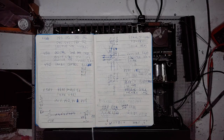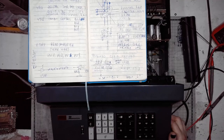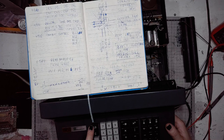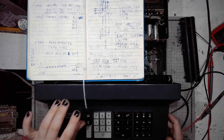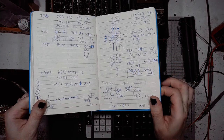The additional registers I showed you before, using those columns of keys, are not included in the erase loop, and the erase loop is activated by pressing the L key. This basically passes a pulse of current through all the cores of the operational registers and the main accumulator, clearing the contents of the memory.